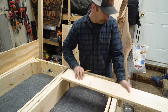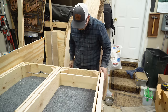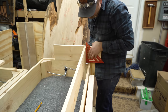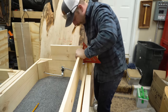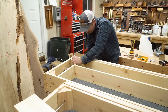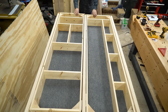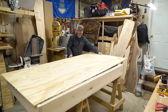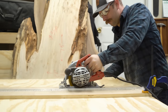Then I'm going to lay out and install a bunch of different drawer dividers based on what I plan on keeping in my drawers. The way you lay out your drawers is totally going to be up to you. I do recommend putting a board across the front to block items from interfering and jamming up the locking mechanism. Then I just add the top. I'll cut the top about three-quarter inches longer than the frame to give it a nice overhang over the drawers.